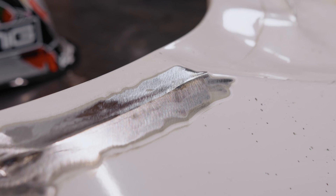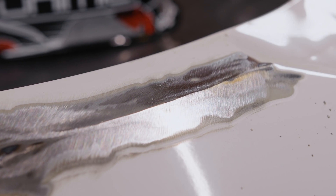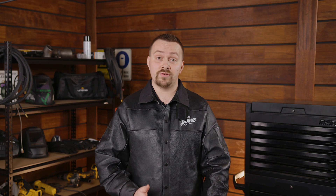TIG welding is usually used on the thinner section of sheet metal as it's more controlled — there's no spatter, you can see what you're doing better, and you can get a cleaner fit. You can also hammer and dolly it as you go because the weld is softer. However, it is a slower process than MIG and can be pretty time-consuming if you've got a larger panel to weld, so you're going to have to be patient. That's our in-depth look at some of the best practices to get a perfect TIG sheet metal weld. If you found this video helpful, be sure to give us a like and let us know what tips you found most useful. Tag UniMig in your projects — we love to see what you're up to, and we'll catch you next time.